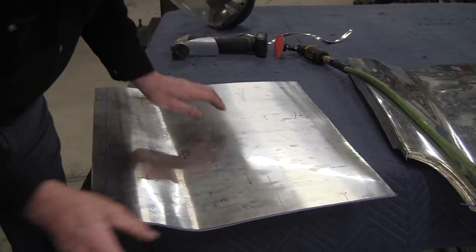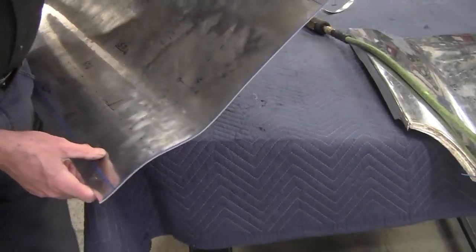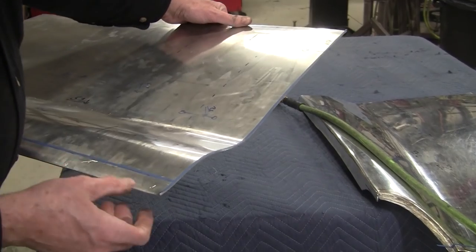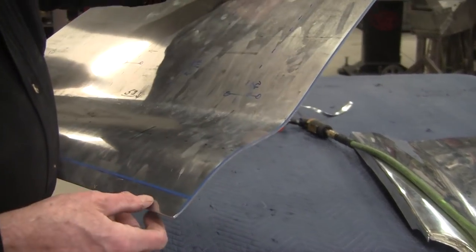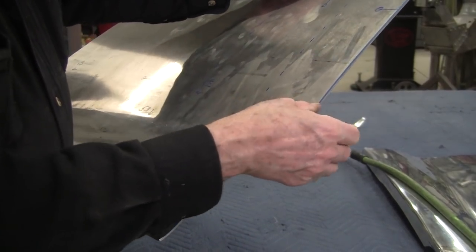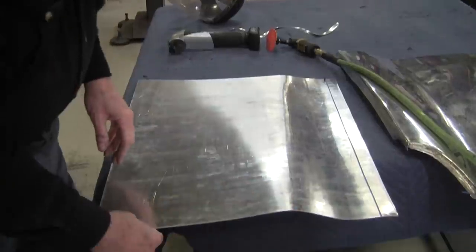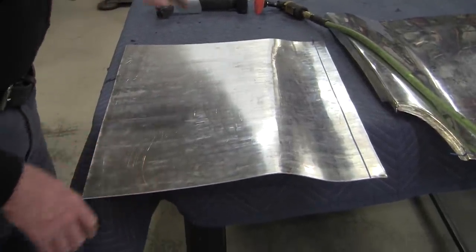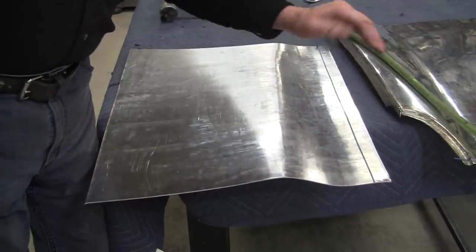All right, the compressor kicked in a little bit, so we'll have to turn that off. But you can see that's a nice clean line now. And now we're going to be ready to tip this edge. So we're going to leave that tape on there for now. We'll get this little fuzz under here. We'll have to sand that off. So I'll sand that off, and then I'm going to go over to the tipping wheel, and we're going to tip that to almost 90.